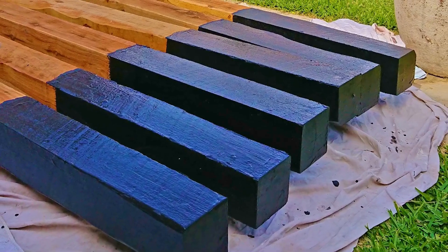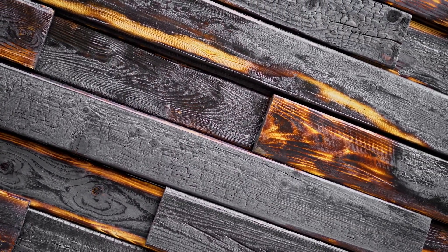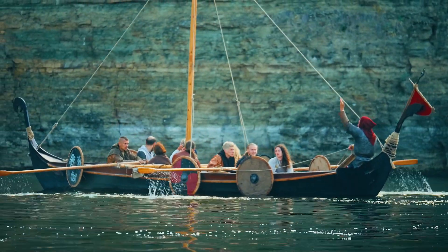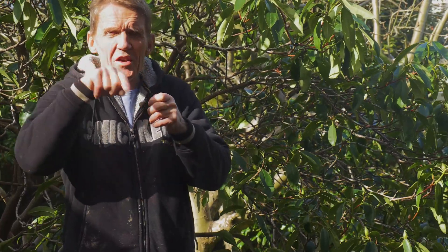Some people say coat the bottom of the fence post in something like bitumen — that will help — but it can also lock in the moisture. The other way of doing it, thousands of years old, is to char the wood. The Japanese used to do it, the Vikings used to do it. Charred wood basically kills anything organic on the outside of the timber, meaning insects aren't interested and rot can't grow on it.